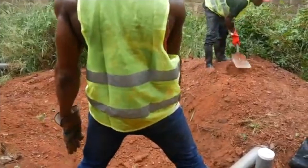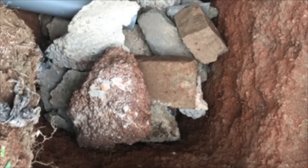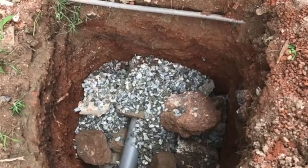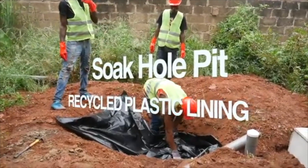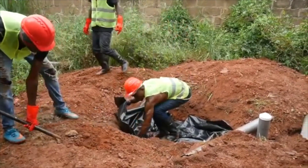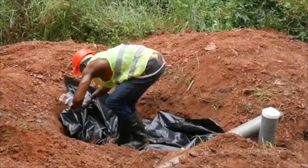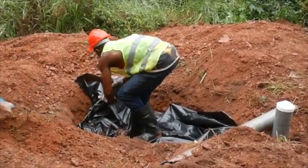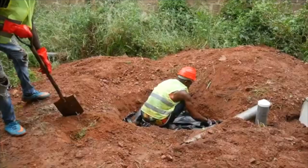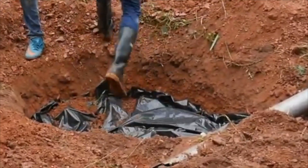Line the inside of the soak hole with a piece of recycled plastic. The plastic should cover the rocks and go up the sides of the hole slightly. The top lining ensures that rainwater does not seep into the soak hole, allowing for easy penetration of wastewater from the digester only. On top of the plastic lining, backfill the soak hole with the same soil that was dug out, making sure nothing will block it and prevent water from flowing in as required.